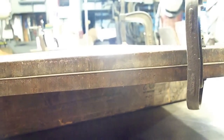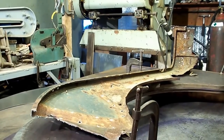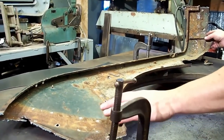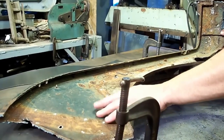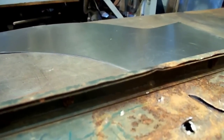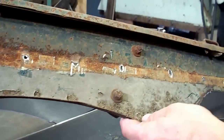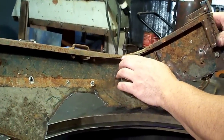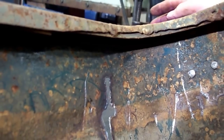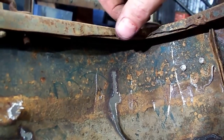Here's a piece of that original 3B tub that I'm rebuilding - just a short section of the side panel. It was in tough shape, that's why we're making new ones. You can see on the body tubs there's always another little bent piece in there - this thickness was doubled up where all the footman loops went through. You can see from the factory how they relieved this area here. There's a lot of material to come around this corner and shrink. We're going to cut a section out and weld it in. You can see how rough it was from the factory.